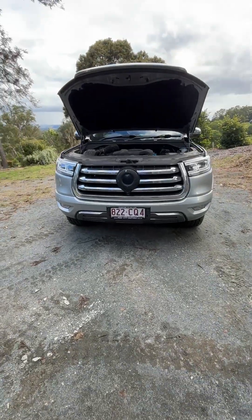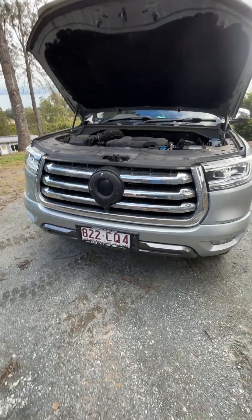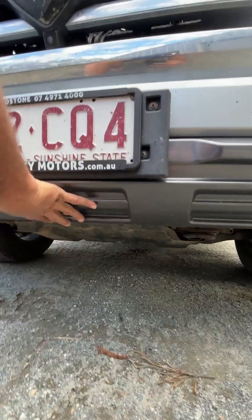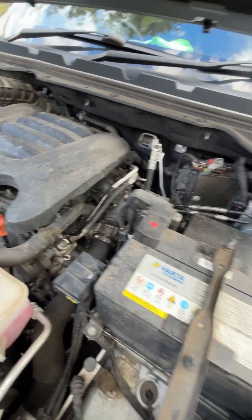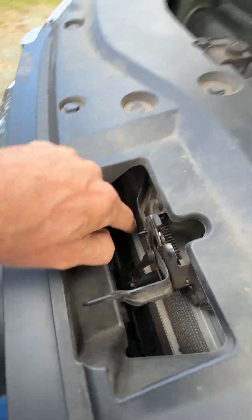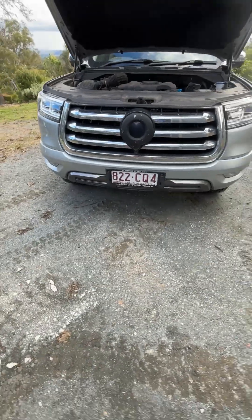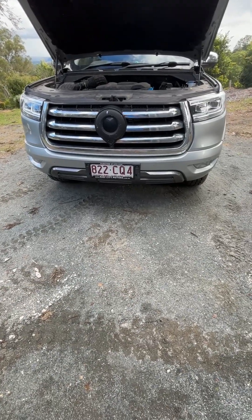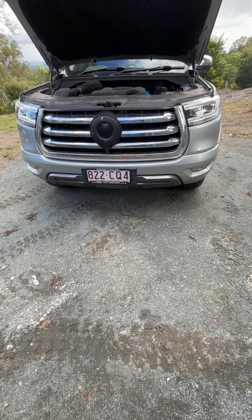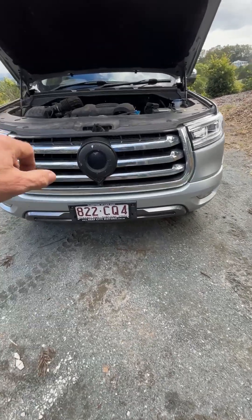A car has air being forced through the radiator travelling at 100 kilometres an hour, but that's not really what's happening here. What's actually happening is this system of panels underneath, the cowling, and the suction created at the back actually sucks the air through. If you were to take that bottom panel off, a lot of air will dump before it and your engine will run hot. I've done this myself — I replaced a couple of engines and battled heat issues until I found out that without those bottom guards, your air is dumping before it even gets to the radiator.